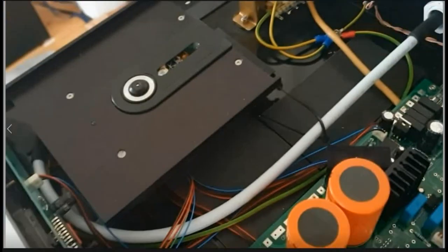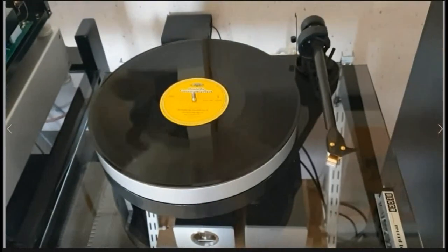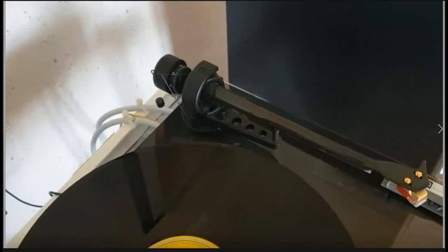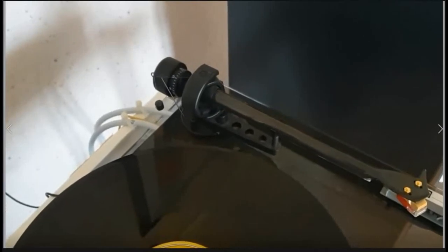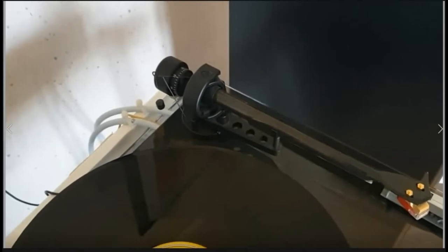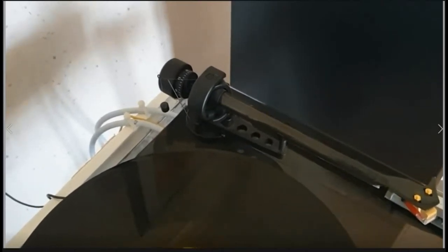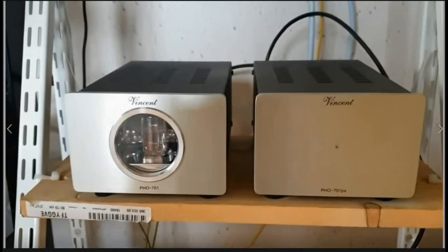Here you can see how I have introduced the signal cable. As a turntable I'm using a Pro-Ject RPM with an Audio-Technica cartridge. On the turntable I have followed the same path as with the power amplifier — I don't like having mechanical connections. So the thin wires going through the tone arm from the cartridge down to the base of the turntable are directly soldered to the interconnects. There was also an audible improvement by not using any RCA contacts here. As a phono pre-amp I'm using a Vincent PH-0701.